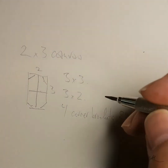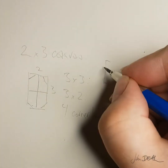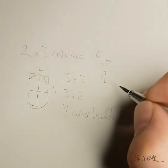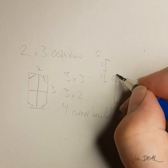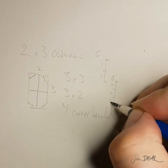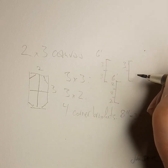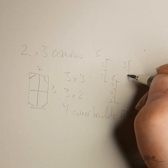I like to draw a line to be the length of wood and then divide it up into the smaller pieces I need for the project. This helps me visualize my cuts. If I need 3 three-foot lengths I can fit 2 pieces into a 6 footer which leaves 1 three-foot length remaining. I can fit all of the 2 foot lengths into 1 six-footer. Now I can fit all of my brackets in with my lonely 3 foot length. I didn't write it down here but I'll also need about the same amount of quarter round.